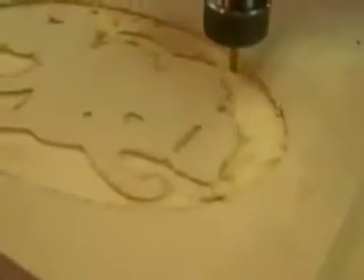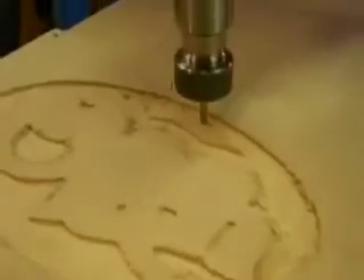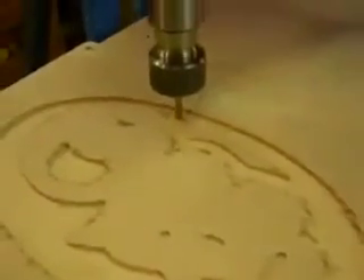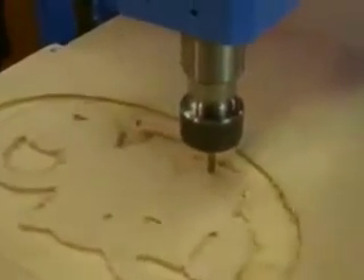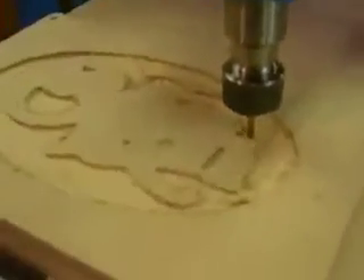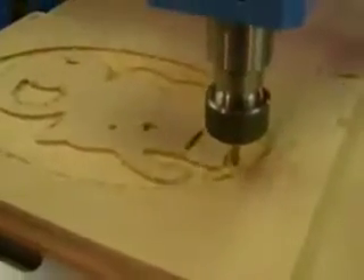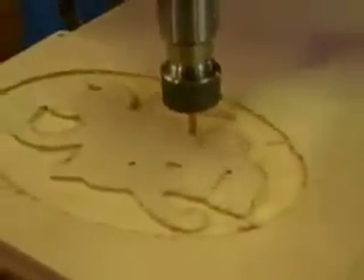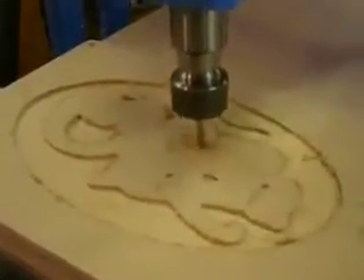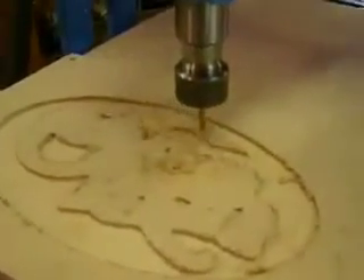It looks a little rough around the edges, but once it actually uses the V-bits around the edges, it cleans up really nice. It turns out quite well. Even at an extremely low spindle speed — it's probably only turning at about 2500 RPM or so — if I crank it up any more, it seems to want to stall fairly easily, even on its own sometimes.